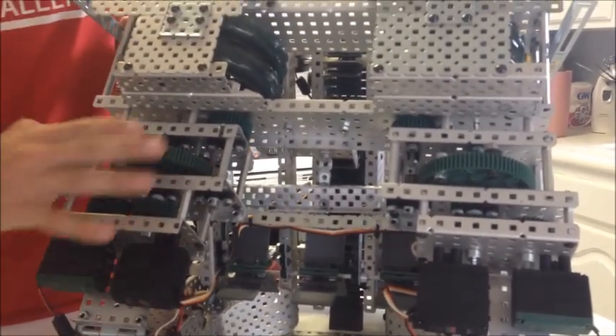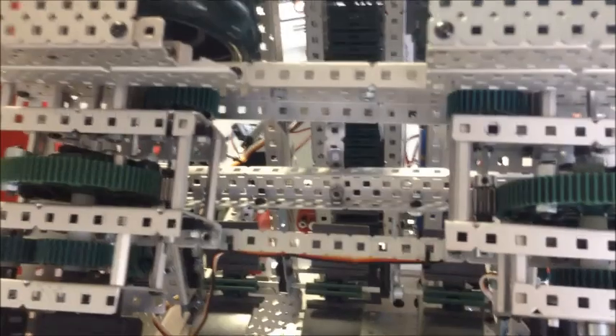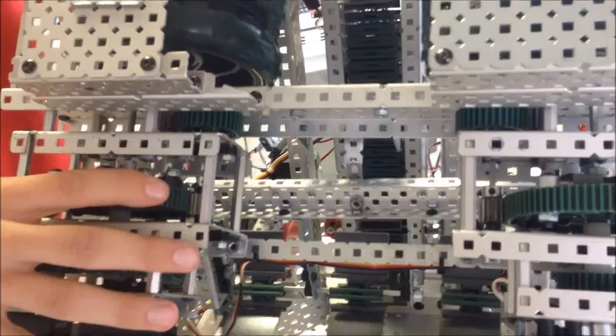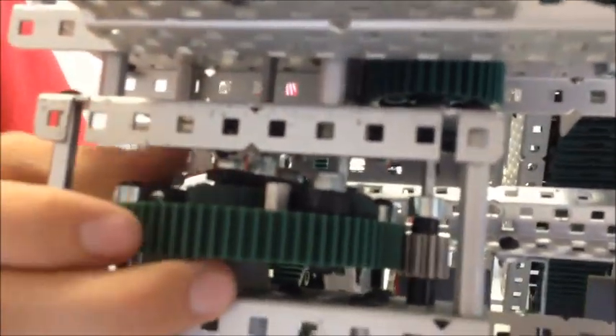Our next problem was with the gears — after turning them on and off a couple of times, the wheels would just not come back on. It's because the motors were heating up when we stopped the wheels. So we added a ratcheting gear off of Rec 1727B's design — we'll put a link to his video in the description. We added the ratcheting gear, and that has really helped it. We haven't had any problems with speeding up and slowing down since adding that.